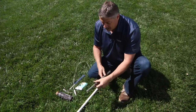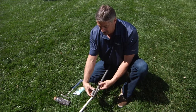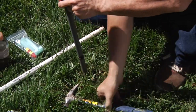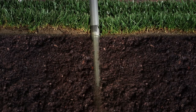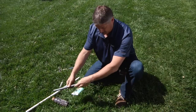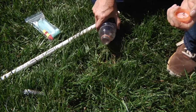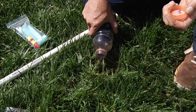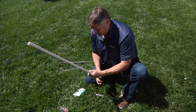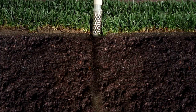With the turf application we're going to go down about 6 inches. I've put a piece of tape here at the 6 inch mark and the sensor will end up roughly at the bottom of the 6 inch depth. So let's go ahead and make our hole. We'll get to the actual root zone and drive in our plastic pipe to about the 6 inch mark. We'll carefully remove the soil out with the plug. Take our slurry mix and pour some right down into the hole. This will aid in settling the sensor into its location. Now I'll take this other piece of plastic pipe, run the wire through the pipe and out the top end of it, and this will help me actually get the sensor pushed all the way down to the 6 inch spot of the hole.